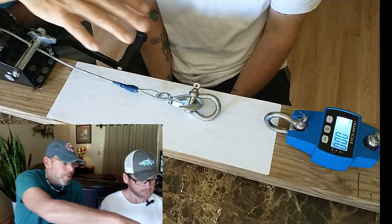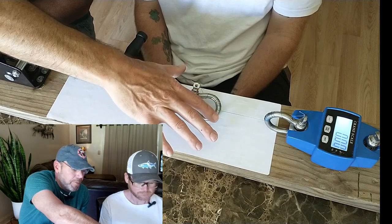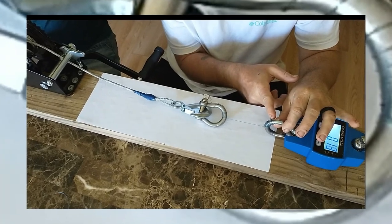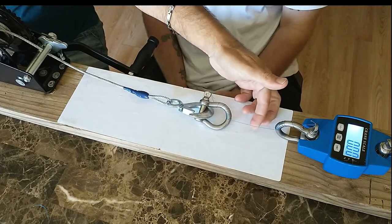We've got a certified scale right here. The way Justin's done these knots — there's actually no knot in it, this is all wrapped. He's individually wrapped this so we don't have any line-over-line parts where the line could cut itself and break prematurely. What we've learned in building this machine is the line will break right in the middle every time. If you use knots, it would break at the knot every time — which opens us up to check knot strengths later. We need to see what the actual breaking strength is, so nothing is wrapped over itself at any spot.